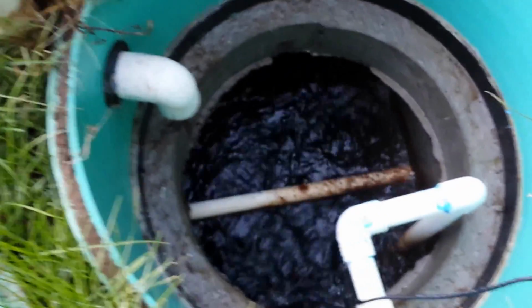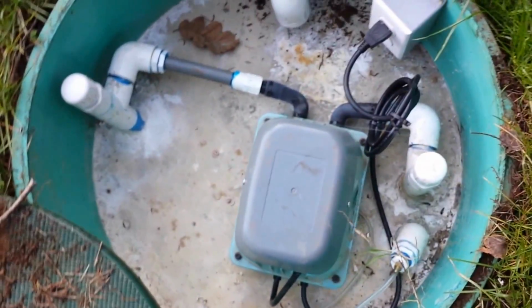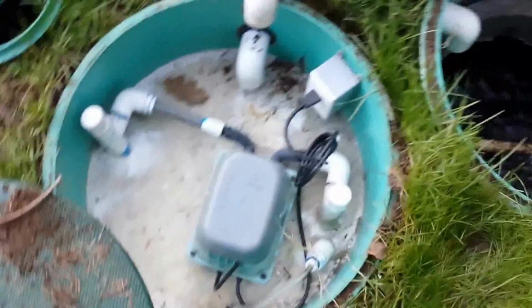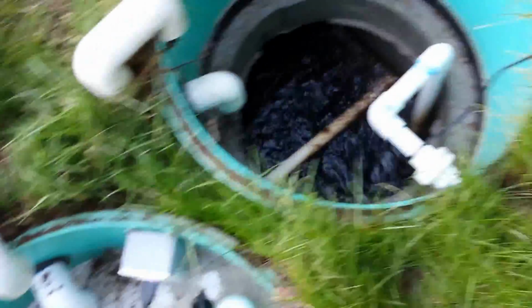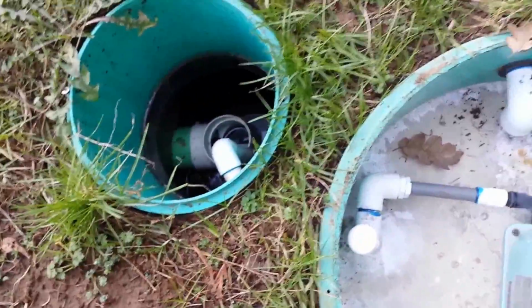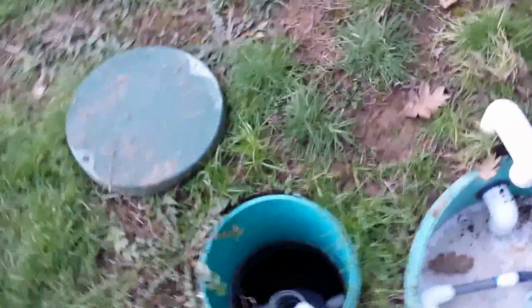This air that you see that's being pushed in is supplied by this blower here. It's a two-stage blower. I'm not going to get into what it does all the way, but at about 2 in the morning it shuts itself down and lets everything settle out in that tank, and then it changes direction and pushes the solids that were building up in the ATU back into that tank there. That way we try to always make sure we have the cleanest water coming.